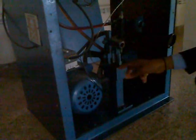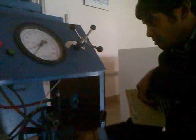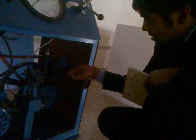First of all, you can see here there is an electrical motor connected here. This machine is connected with a hydraulic system — it totally converts electrical energy to hydraulic. When the electrical motor rotates, hydraulic pressure is generated, and that pressure drives both the compression and tension tests.